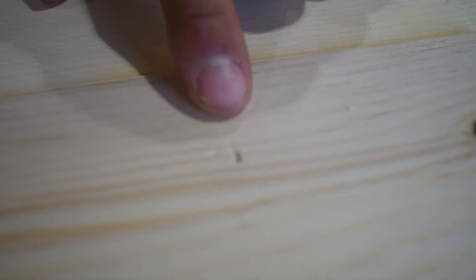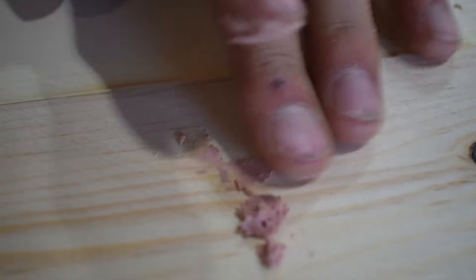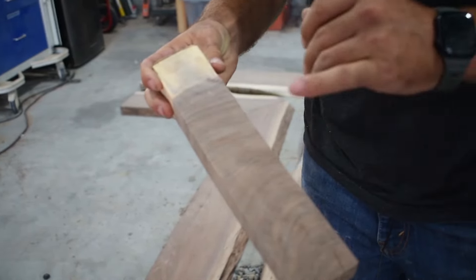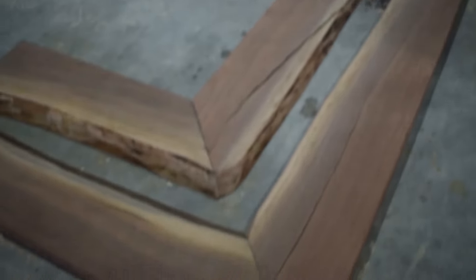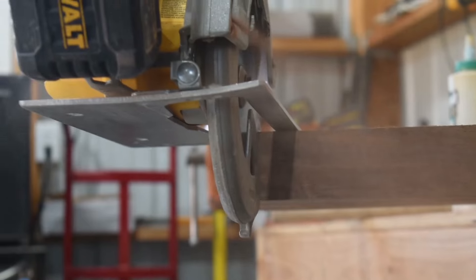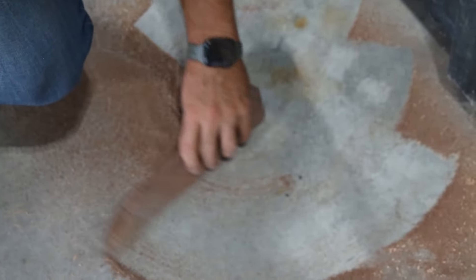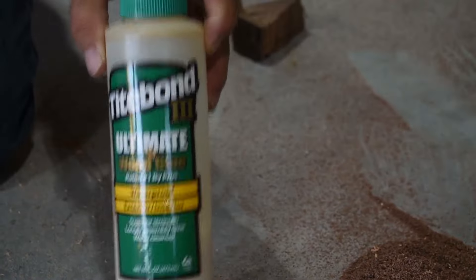But I will show you how we can make our own wood putty for different species of hardwood. If you have some nail holes like this from your brad nailer, I would also put some wood putty in there — just dab a little bit on your finger and come right over the top. Once you stain that area, it will blend in much better than just having a hole in the wood. So let's say you're working with a hardwood. In my case, I'm building this walnut live edge epoxy bar top, and I need to make that seam much cleaner by making my own putty. I'm going to take the same species of walnut — this is just a scrap off of there — and we're going to create a lot of sawdust from this piece that we can then mix with glue to put in that seam. Now I have all my sawdust made from that walnut, and I'm going to mix that with some glue here to make our own putty to fill in this seam.